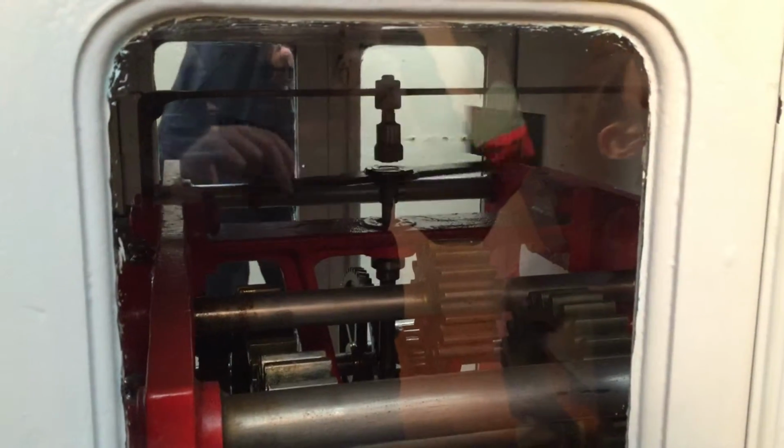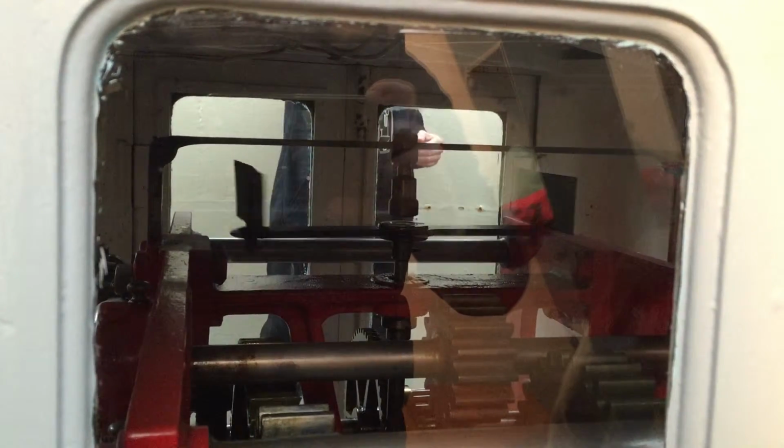Now, you'll see our lens itself turning here on the bearings and the wheels there. Some of the lenses actually floated in a bath of mercury. So the less friction, therefore far easier to turn, less resistance, so far easier to wind up. But of course, a mercury bath in front of you is much more of a health and safety hazard than having your lighthouse on the lens on the runners there.